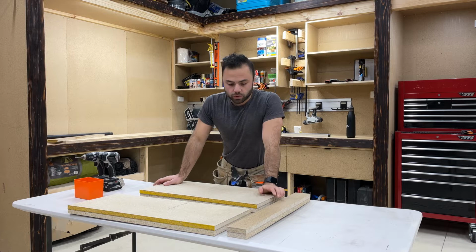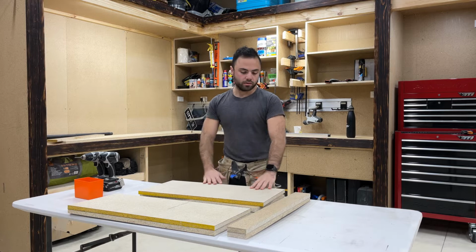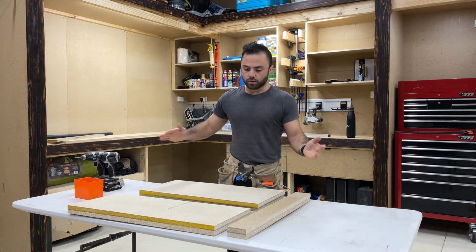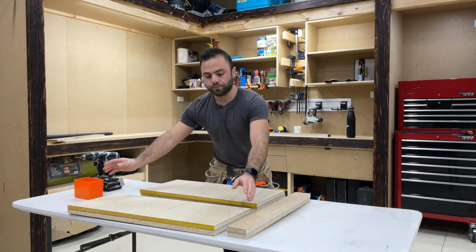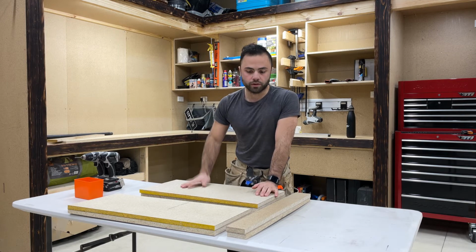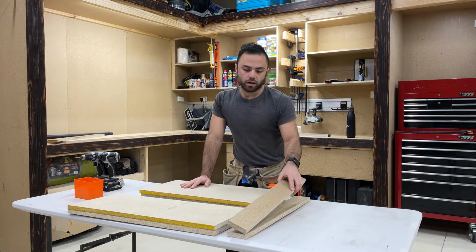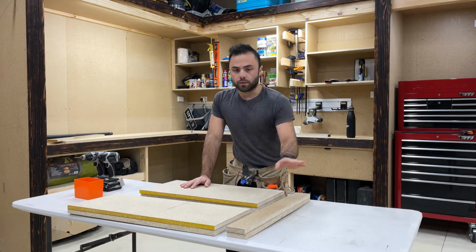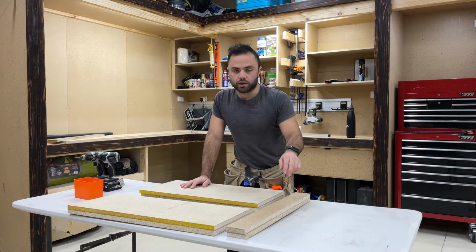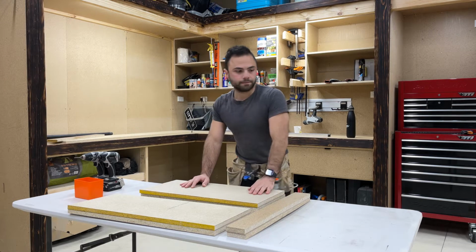So I'm just going to put all these together. I've done these in previous videos, you want to see up close how I do it, but pretty much just got the three shelves, bottom, middle and top, two end panels and a rail across the back. Pre-drill and put in 50mm screws really. Pretty simple little shelf, and then the rails are top of the shelf sections flat so they don't bow along the back, and you can use those to screw into the back wall. So let's put them together.